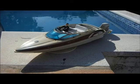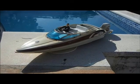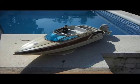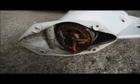So, either the strimmer line isn't spinning freely in the sheath, or there's something up with the motor. I'll have to check. Perhaps the problem isn't with the flex drive that I've installed at all. Perhaps the motor has also gone south, coincidentally, at the same time. The best way to check is to run the motor without the flex drive and see how hard it revs. One thing I did notice in the pool was that it ran a lot better backwards than it did forwards. So let's see if that's the case now.